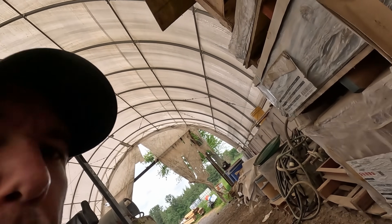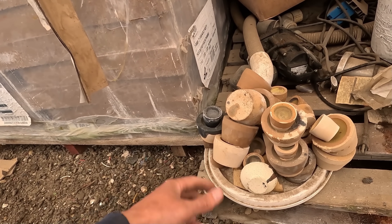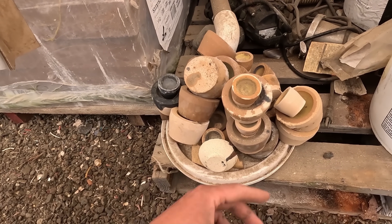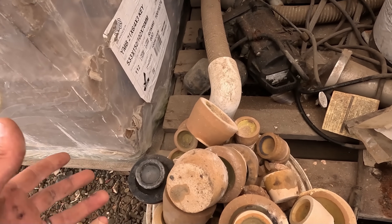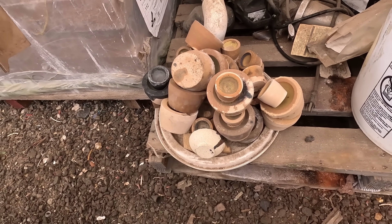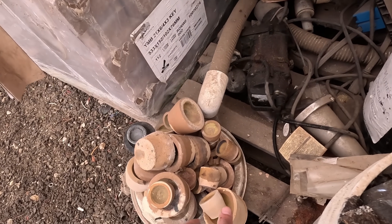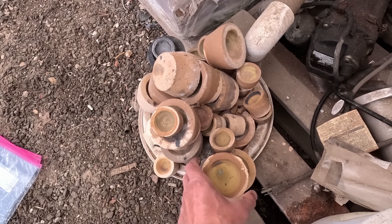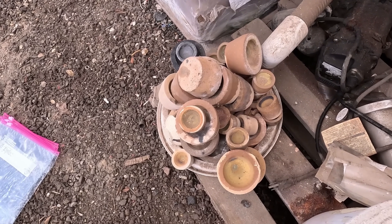Using that molten borax ring around the bottom of the button, it'll pull those solid oxides off and refresh the surface so we can continue to oxidize whatever other base metals are in there. That's why I'm not using a cupel for that last half a percent or percent of material. Here's something I'll throw out there — I'm trying to clean up the shop. These are all my old cupels from the last couple of years, and a lot of you email me asking if I have any to get rid of. I'm going to bag these up and put them on eBay for a buck and start the auction that way — you guys determine their value. A lot of them have gold in them. Check out the eBay listing, I'll put a link in the description.